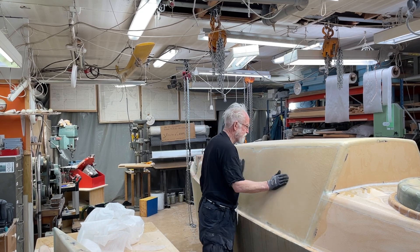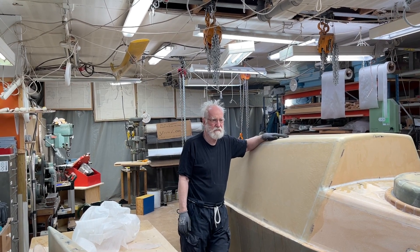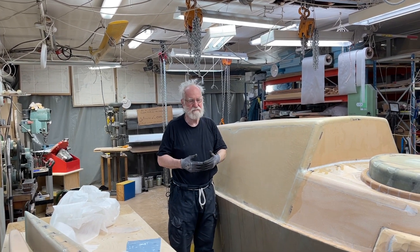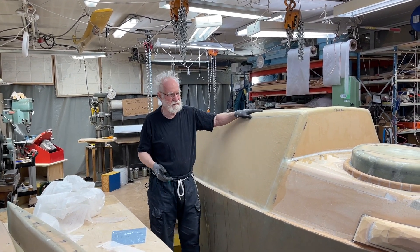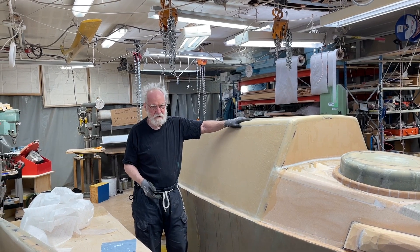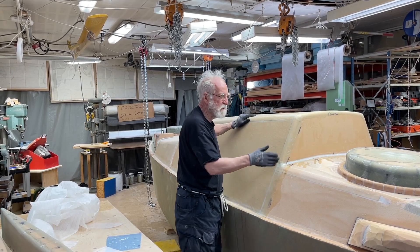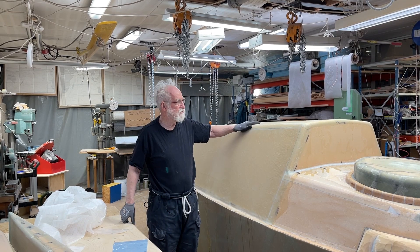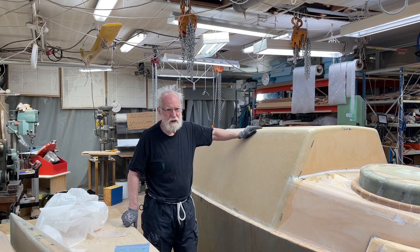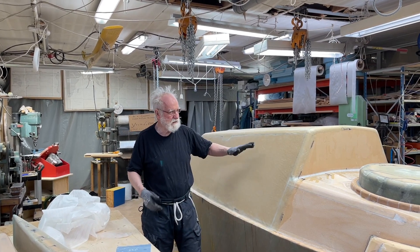I was a bit worried — this is really strong. After 24 hours, 90% of the chemical bonds are done. After one week, close to 100%. But also, if you're really quick — within 24 hours, if you start applying the next layer, you get a chemical reaction between the two layers. So if you're quick, it's a good thing to do that. Don't wait too long. If you can do it within 24 hours, you get both mechanical and chemical bonding.